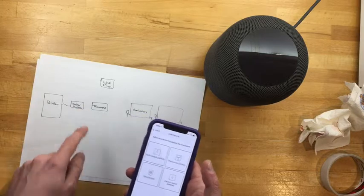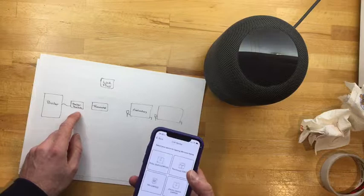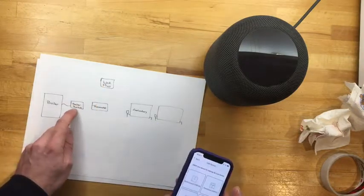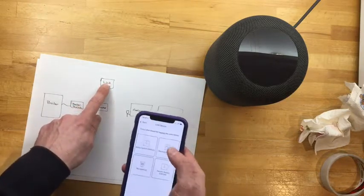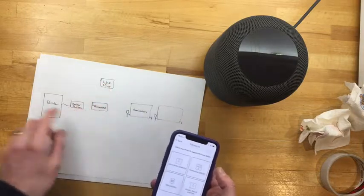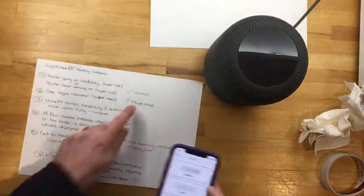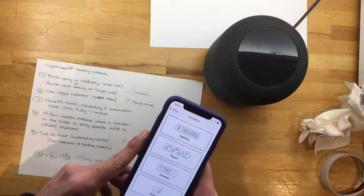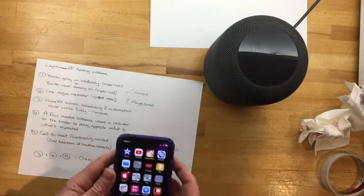So it's a bit confusing that the boiler switch was there as something that was available to be linked. But what I since learned was that I wasn't to link the boiler switch to the Link Plus with the app. What I was supposed to do was link the boiler switch to the thermostat with the link buttons, and then link the thermostats to the Link Plus hub, which is what I did. And since then, this problem, number 1 in my list, seems to have gone away. So I think that's sorted. I kind of think maybe somebody at LightwaveRF wants to make the instructions a bit clearer on that, because that wasn't clear to me.